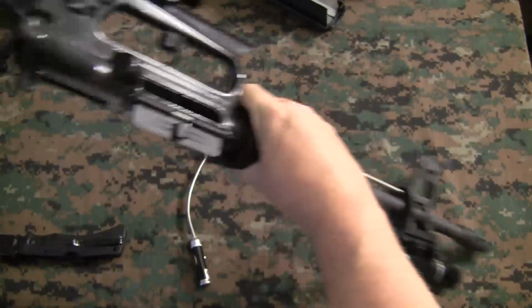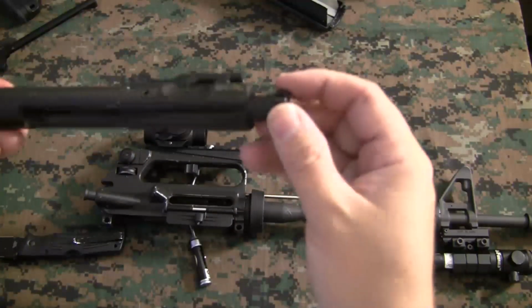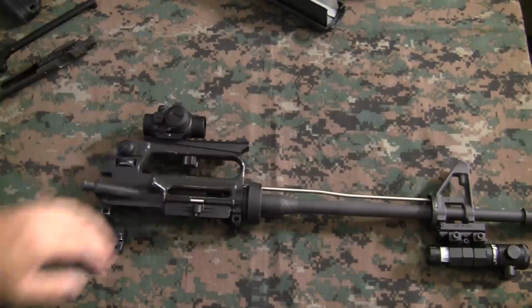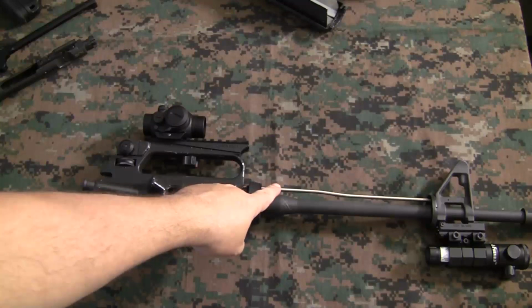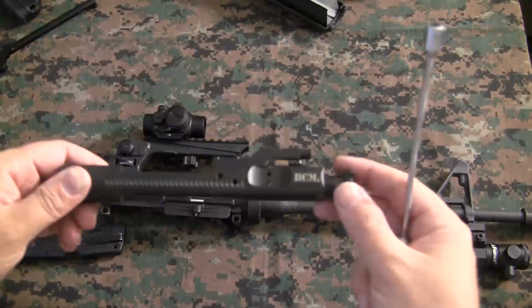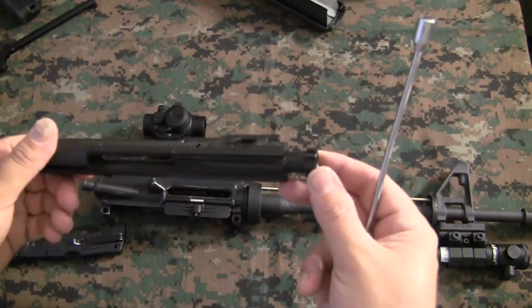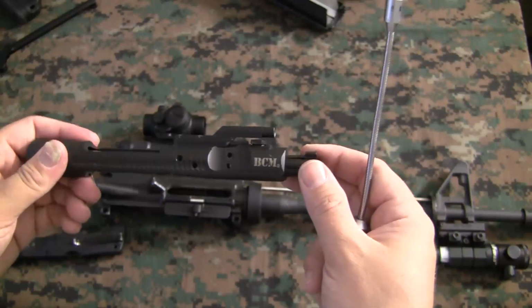But anyway, all that carbon and dirt builds up in the chamber, and it builds up because it's being sprayed on the end of the bolt and causes them to get gunky and sticky. Now, in the first M16s in Vietnam, this was a big problem because the ammo was very dirty. These gas tubes weren't corrosion proof. The troops were told by the Army that these bolts didn't need to be lubricated or cleaned, which Eugene Stoner did not tell them. They just decided to make that up as they went along.